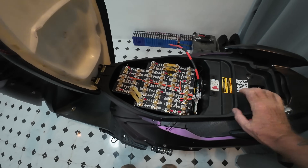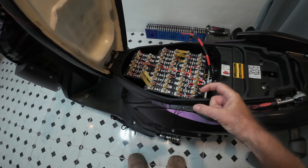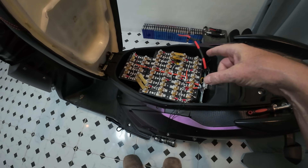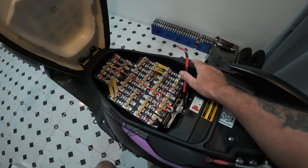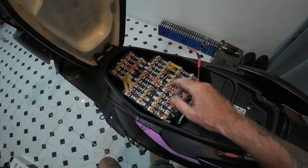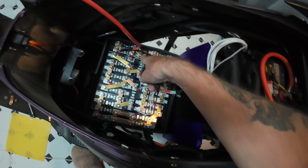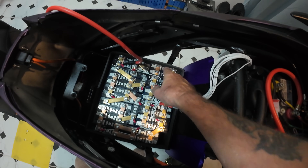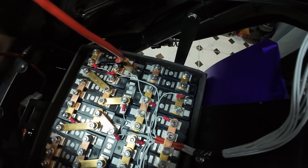I've got to take this battery out again — everything's got to come out. I need to get access to underneath and replace cell number 14, which is the first one on the bottom. It's always the bottom ones; I don't know why but that's the way it works. Even the one I nearly set fire to is fine — it's this one. When it gets to about three volts it drops like a bloody stone, and the rest of them are perfect, so that one's got to come out.